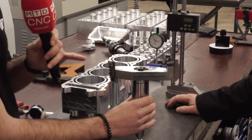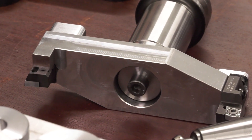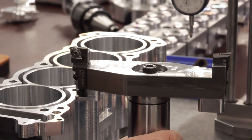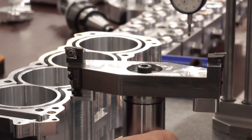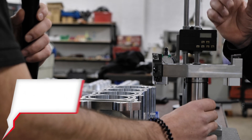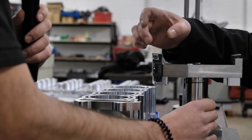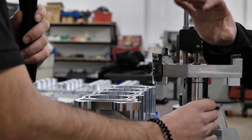So you've got a standard shell mill arbor, face mill arbor, and you manufactured the rest of the holding body. Yeah. Most people use a single insert face mill — they take all the other inserts out — but why have you got two inserts here? Normally you just need one because you need a nice clean surface. Well, if you had just one you've got to go slower to get your finish. If you use two inserts in a standard face mill you can get differences in height, so doing it this way with these cartridges — they're adjustable — I can set the height of these absolutely bang on.